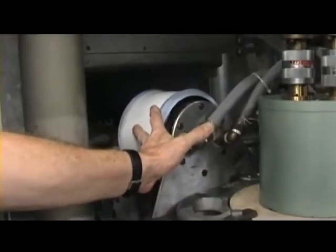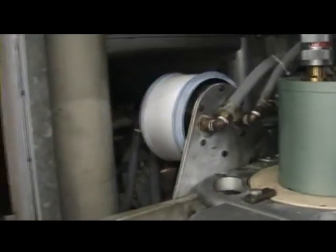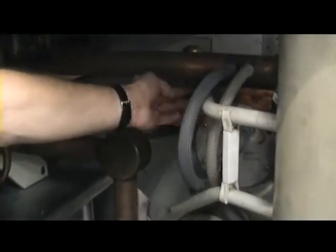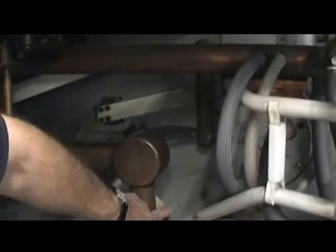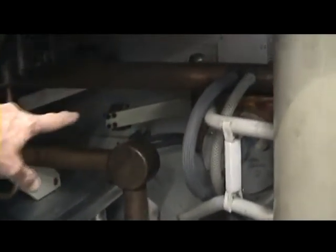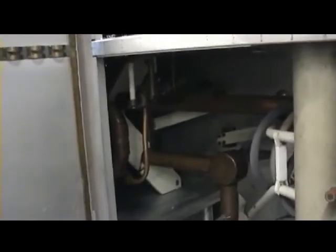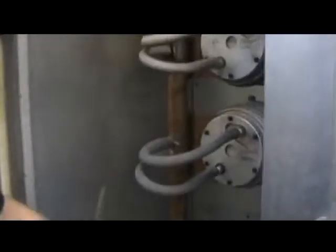Here again is the pen, and here's the final stage. Water-cooled vacuum capacitor with a ceramic body — that carries the full 300 kW plus modulation — to hit the output stage pi network, which starts here. The first thing it finds is a motorized capacitor to earth. We blow the edges of these foils because the RF always wants to go down the edge, not across the whole foil — it tends to fry the edges, so we blow those with air to keep them cool. At the back there is one of the shorts that's open — that short would close on 26 and 21 megahertz, but it's open on this frequency, which is 15 megahertz. The RF runs down through 54mm copper pipes, and after going through a couple of pi sections, ends up at the back on this final run out from the bottom.